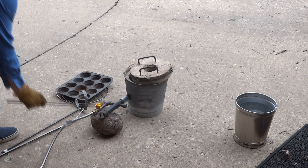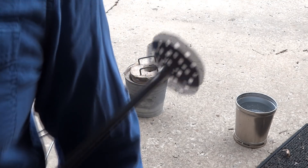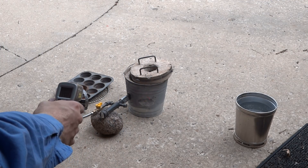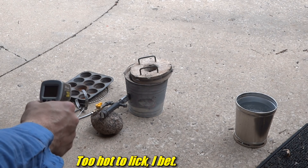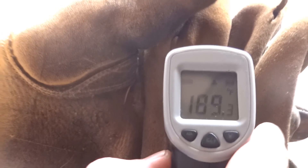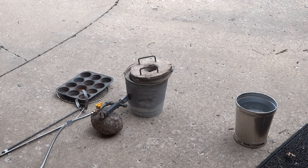D-gassing — that's for removing the hydrogen. These are ingots; I don't care if they've got holes in them. Here's a fun experiment: how hot is the outside of that already? Pretty toasty. My gas valve is not — the gas valve is only 85 degrees. Not bad. I was a little worried with it being so close.